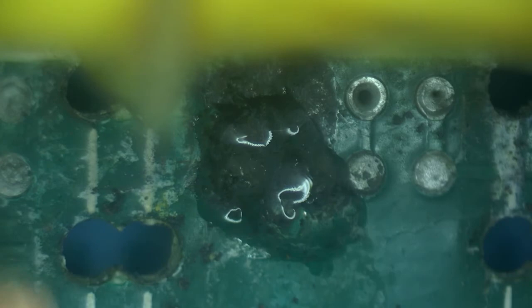One of the tricks to try to fix this is to actually use the iron to heat it up to the point where all of the corrosion starts falling off. I'll add a little bit of flux. And let's do it. I'm getting solder out. That's always a good sign. Yeah, there's some shine underneath all of this. Except perhaps for this one, maybe even this one. Okay. One pin must have corroded pretty badly, but the rest, oh, and even this. Oh yeah, that's going to be fixable. That actually looks pretty good.